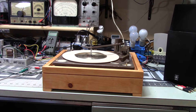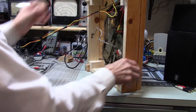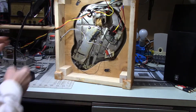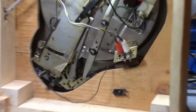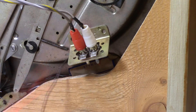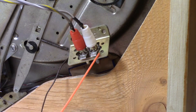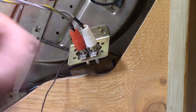Trying to figure out what was going on — let me flip this back up. There's a little piece of circuit board material here that these two RCA jacks are mounted on, and that isolates them from this chassis. Which means that this is not really grounded to anything — it's just there.